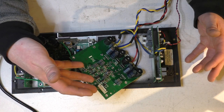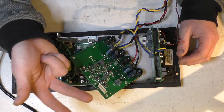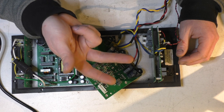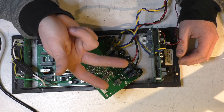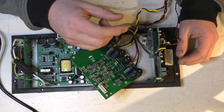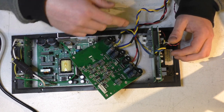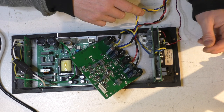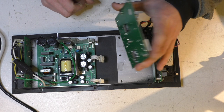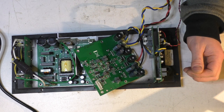The amount of times in class D gear or digital gear in general where a clock line, reset line, or enable line has gone short or lost connection — there's nothing booting the thing. It's just sitting there waiting to start running but not getting a clock signal, or the chip is permanently in reset, or not enabled by the enable lines. It happens quite a bit and it's very cheap to fix. That's one of the things you always look for first. Anyway, I'll get this back together, put some more shmoo on there, put it back in the box and send it off. Thanks for watching.